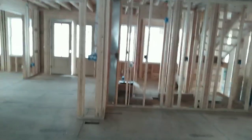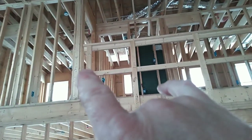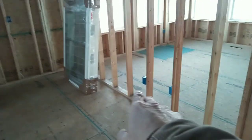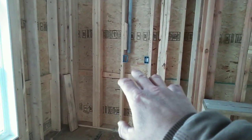Let's take you upstairs. All this is loft area — they're going to have handrailing from there all the way over to that wall. This is temporary construction railing that has to be up to code so workers don't get injured. I didn't finish telling you about the outlets — this outlet here is within six feet of the edge of this doorway, and then this one serves the kitchen cabinet entertainment area, more like a dry bar or entertainment zone.